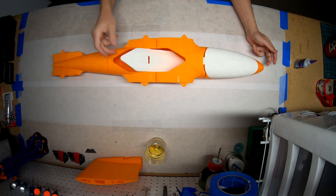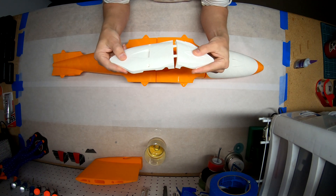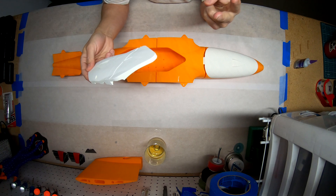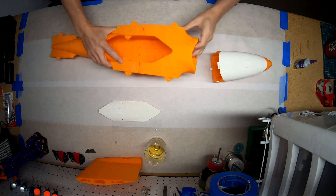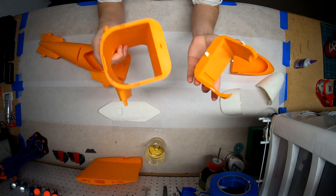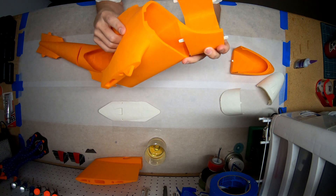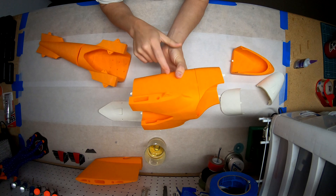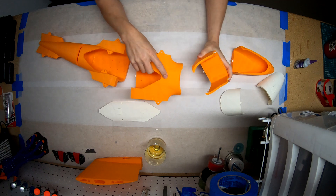This thing is not glued together — it's falling apart because we've got a little trick I'm implementing. I've got files on Thingiverse and a second video where I'll show you in Fusion 360 how you can print bigger parts on a smaller print bed, and also by using these biscuit interconnects make the gluing process smoother and more confident, especially if you don't have the steadiest hands. Here's what the fuselage looks like — I had to cut this down.